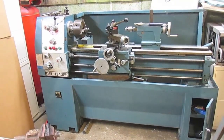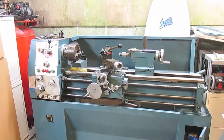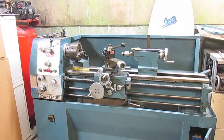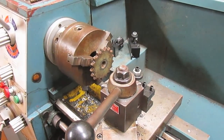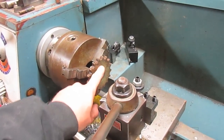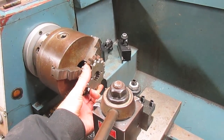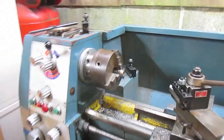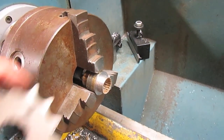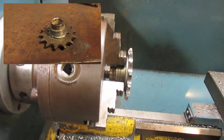I finally got a lathe — I've been wanting one for quite a few years. My buddy Dave kept recommending I just go bigger, so I ended up getting a bigger one than I was planning. I got the 17-tooth stock sprocket chucked in the lathe and I'm going to cut off the sprocket, leave a little lip so I can slide the new one on and weld it, keeping all the internal splines. Got it cut down and this is the new sprocket — it fits on now and I'm going to weld it from this side.